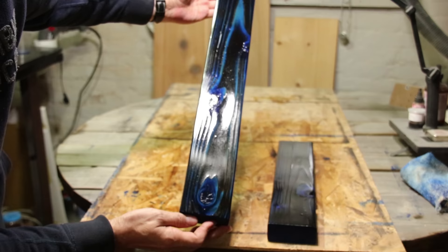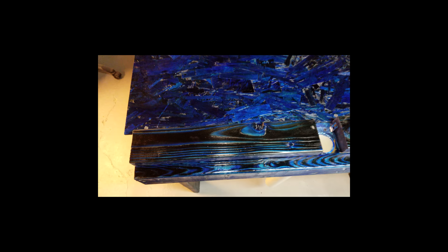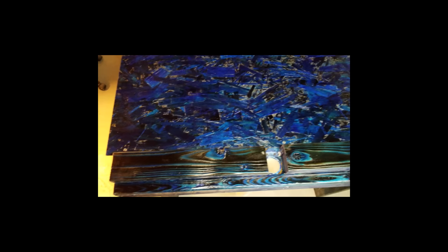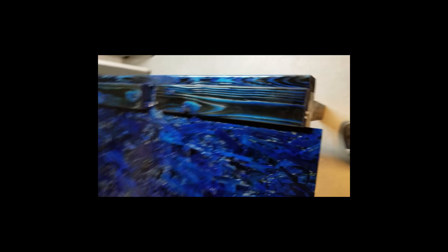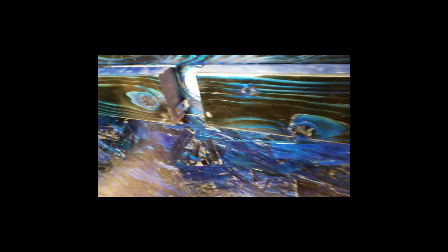I really hope this is something you guys enjoy. If you like it, let me know — I can try to do a purple, maybe a yellow or turquoise with this kind of technique, just to see what it looks like. By no means am I an expert with Shou Sugi Ban — this is actually only my second or third time doing this. It's a really simple technique and it turns out absolutely beautiful. There's the chipboard — I ended up using the dye stain and putting the dye concentrate drops onto that chipboard and it turned out absolutely beautiful as well. That back board is just a pine two by four. I did not use the concentrate on there — it was just the 12 ounces of acetone and one teaspoon of the blue dye.